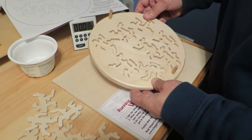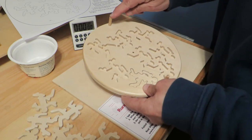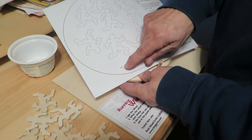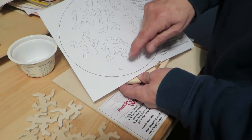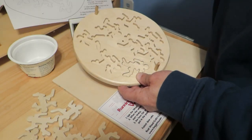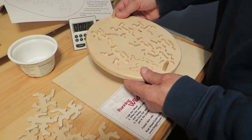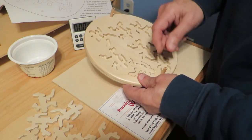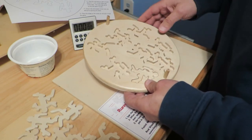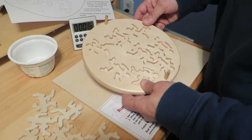Once you cut out the 2, you can then take a 1/4-inch drill and drill the 2 side holes for the handles. Now those are set up for you on those little X's. You can drill them right there with a 1/4-inch, and then get a 1/4-inch dowel, again about, I'd say, 1 inch long, 1 1/4 inches, something like that, and just slide it through the hole to the bottom. Now you might want to do this even before you cut out the circles. That way it'll hold the circles in place for you while you're working with it.